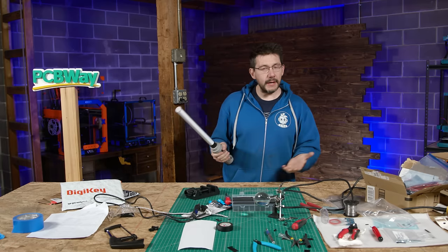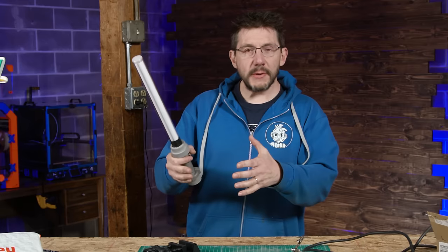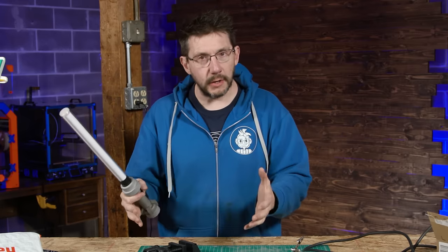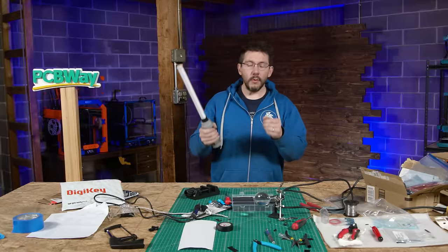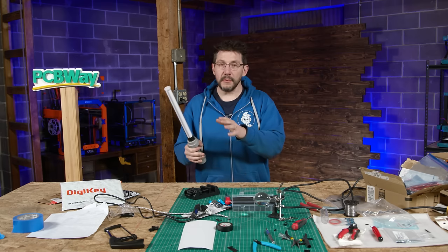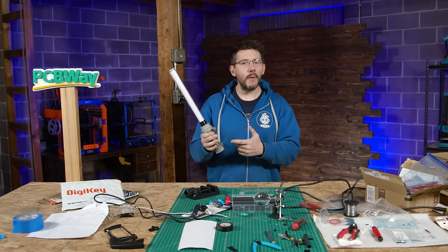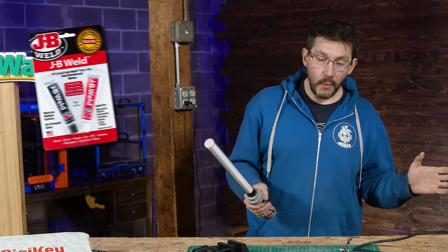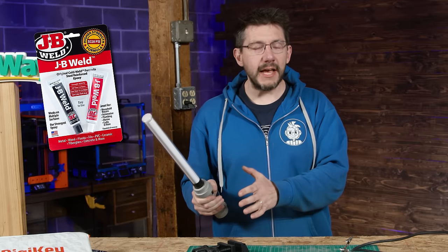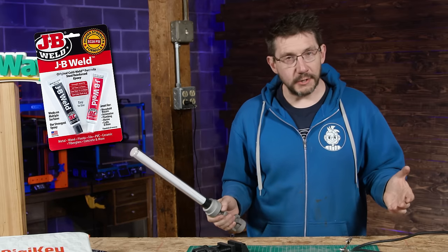And assembling the metal parts is a little bit different because, again, we're dealing with geometries that were going to be made and assembled using a plastic polymer rather than a metal. So while cyanoacrylate glue will work with the plastic parts, for metals, I went with JB Weld. JB Weld, great epoxy, 4 to 6 hour set time, full cure 15 to 24 hours, depending on your temperature.